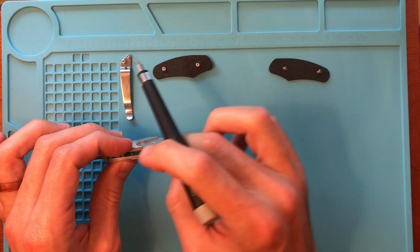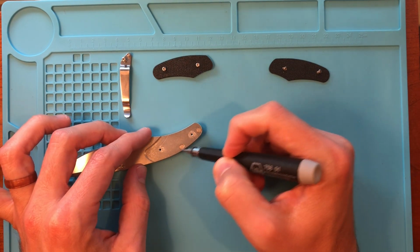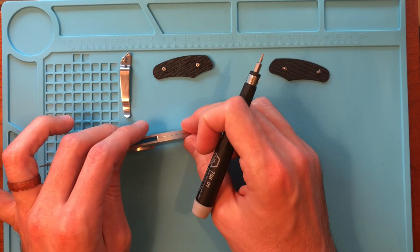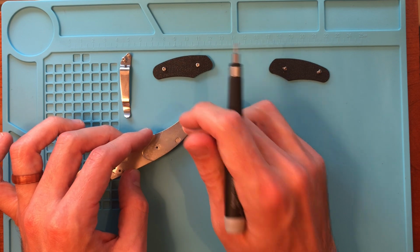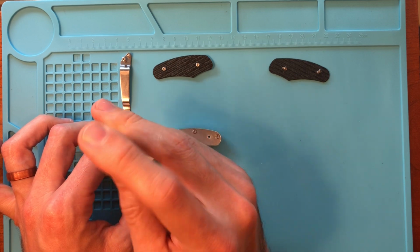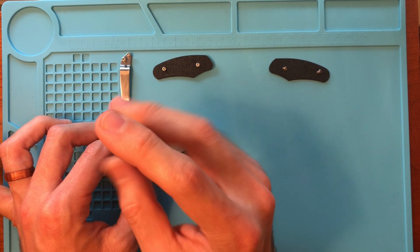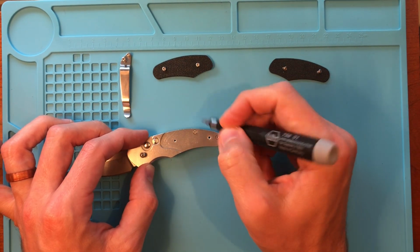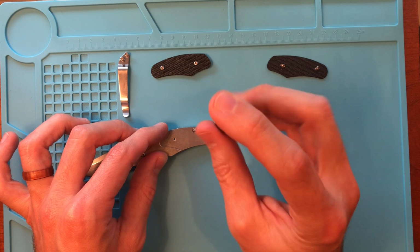It doesn't really have standoffs. Both the handle scales are machined in a way that they meet together with that. And then it's got these machined receivers to the screws here that fit into these keyed openings. What I found on the first disassembly was that those are not directly interchangeable. I had trouble getting one of them to seat in there properly, and then I swapped them around and found things went smoothly from that point. So do try to keep track when you take apart exactly which hole these came out of to get them back in the identical hole.